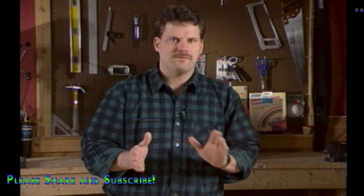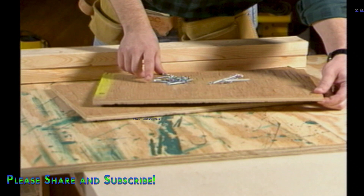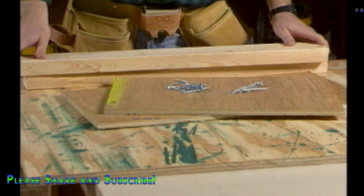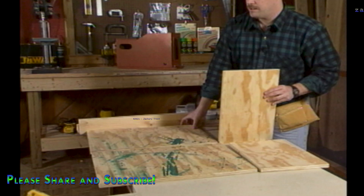We took a look at Carlos's sled — his was made out of one-by-six inch boards and planks nailed together to form a box. We're going to do something a little different, recycling some of our lumber. We have some old painted three-quarter inch plywood, roughly two and a half by three feet, to make our sled, as well as a couple of half-inch pieces of plywood. We'll be using a couple of two-by-fours to form our runners or skis to help pull the sled across the ice, as well as some three-inch and inch-and-a-quarter wood screws. You could use a circular saw to cut the wood — we're going to use a table saw. If you have a two-and-a-half by three-foot piece of plywood, all you have to do is make two simple cuts, and you're already framing up the front and sides of your ice fishing sled.